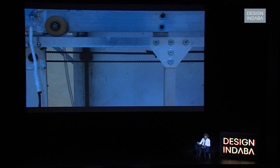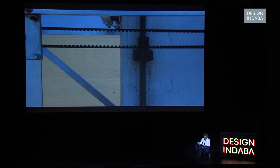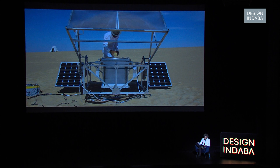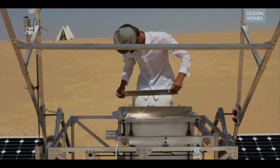The desert can be a harsh environment. Once a sandstorm picked up the entire machine — the lens became the sail and unfortunately also the landing feet. But after a day of repair, everything was working again. I also painfully realized that my barely packaged electronics and even my laptop were not up for the energy pouring down from the sun. We started to build cooling fans from an old can, and my computer ended up on wetted stones for evaporative cooling. For me, a lot of these unforeseeable issues, which take improvisation with minimal equipment, are the most fun — you have to come up with a solution in no time that does the job just well enough.